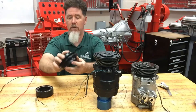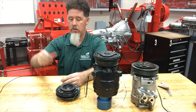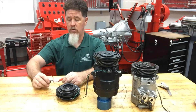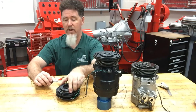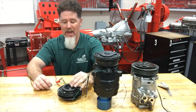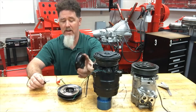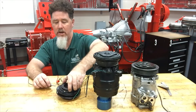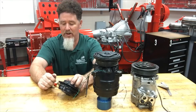This thing doesn't even hold on without power. I have a jump pack connected down here — 12 volts. I'm assuming the green wire is the 12-volt side and the black wire is the ground side. When I connect it, the whole entire thing gets picked up. I've had students try to pull it apart and they can't. When I release it, I can pull it apart. A very strong magnetic field — the whole entire thing gets picked up.